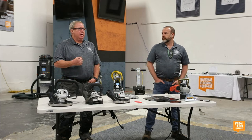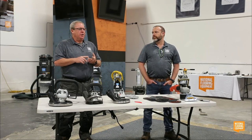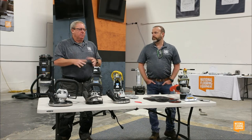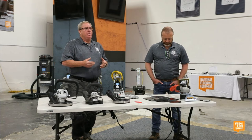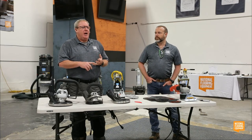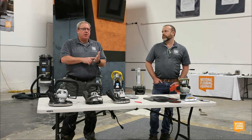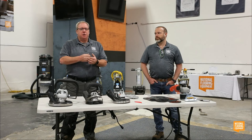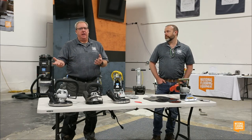So I obviously believe that I'm standing here because of two big reasons. One, people want to aesthetically make their floors prettier. And two, floors fail because contractors don't do the right prep or the right cleanup. I can't tell you how many floor coverings, it doesn't matter whether it's carpet, ceramic tile, VCT, laminate, an epoxy coating, whatever it is, fail because guys don't do the right prep. They leave dust on the floor or they don't put enough profile on the floor. So I don't understand contractors that run out and do a halfway job of the prep and hope that it sticks. And then if it doesn't, they come back and redo it again. How are you going to make any money that way? It behooves you to do the right prep with the right profile the first time. Because if you don't do it right the first time, how are you ever going to make money if you have to go back and start over? You can't.